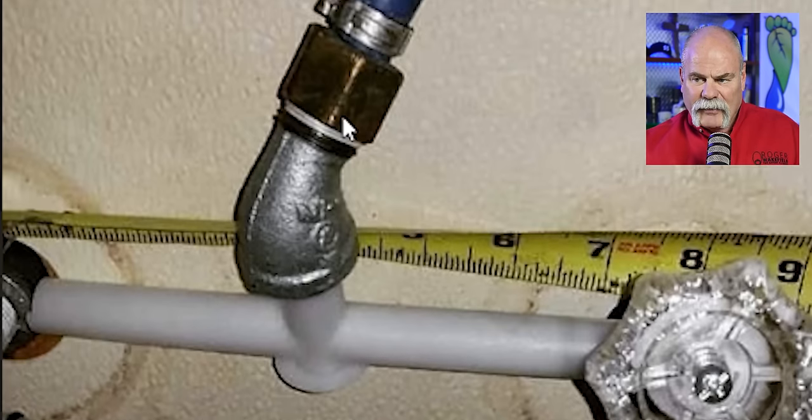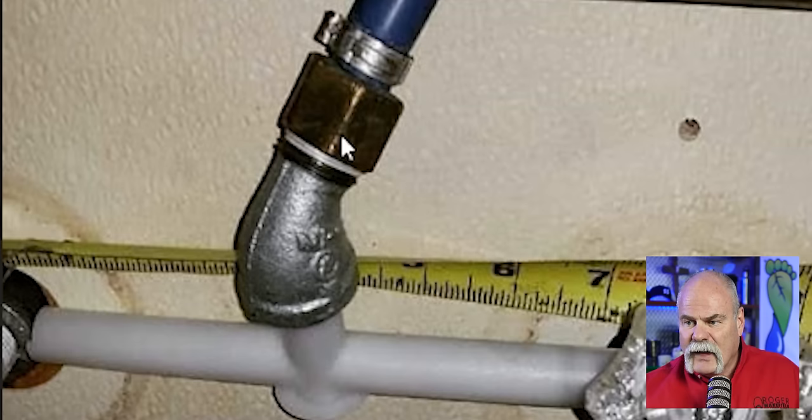This is the inside of the shower. Literally, a kitchen faucet across here, then it comes off and goes to a street 45 with an adapter — a PEX adapter on it. You've got a street 45 or maybe street 22-and-a-half, galvanized, then a female-by-PEX adapter going up to the head. Y'all saw that somebody took a weird kitchen faucet — looks like a mobile home faucet — and adapted it to fit where the water lines come out for the shower, then converted it to PEX to run up to a handheld shower head. They spent a lot of time and labor where they could have just fixed the shower valve. This is thinking so far outside of the box, they may never find their way back in.